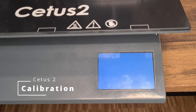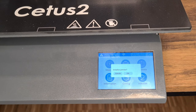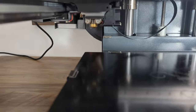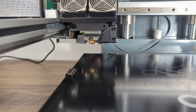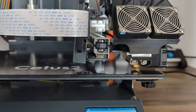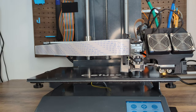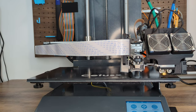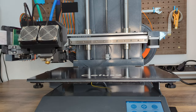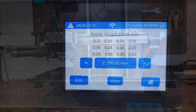After a few seconds, the printer is started and we are in the main menu. Most menu items are disabled until we home the printer, so we hit the initialize button, hit OK, and wait until the homing is done. After homing was done, all menu points are activated and we are able to calibrate the printer. I started with auto bed leveling and after it was done, I noticed that the print bed was not straight, so I had to level the bed first. Bed leveling is straightforward — the print head moves from bed screw to bed screw and after a measurement, the printer tells the user how much to turn each screw. After repeating the auto bed leveling, the result was way better.